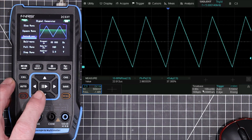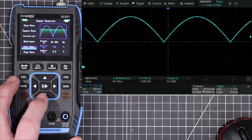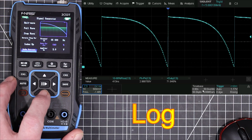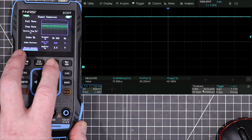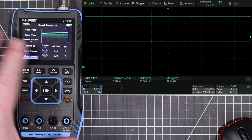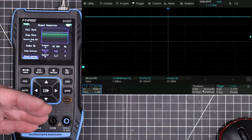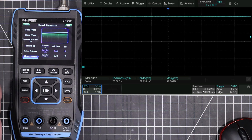Let's have a look at some of the other waveforms. Sawtooth — it looks just a little bit lopsided. Half wave, full wave, step wave, reverse step, exponential function, and DC. The direct current was set at three volts — is that what it's giving us? It is, right on three volts. The voltage is very accurate. These are useful waveforms, but not great for RF since it only goes up to 50 kilohertz. For audio it'd be limited because of the stair-step, unless they filter that out and fix their sine wave. It has nice features: all these waveforms, very accurate frequency and voltage. It does not have offset, so you can't produce a true AC signal. The duty cycle is very accurate in square wave mode. Rise time is not the greatest — around about a microsecond — good for working with slower microcontrollers.